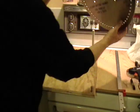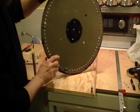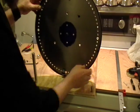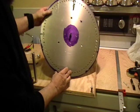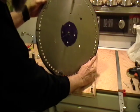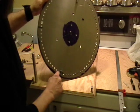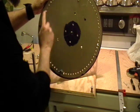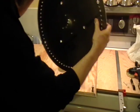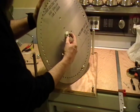This is the disc. This is a quarter-inch thick disc of 6061 T6 aluminum plate. It was cut from an 18-inch square piece of sheet that cost me almost $60 Canadian. It's just under 18 inches across — 17 and 13/16ths inches. One inch in from the periphery there are 72 quarter-inch holes for mounting things.